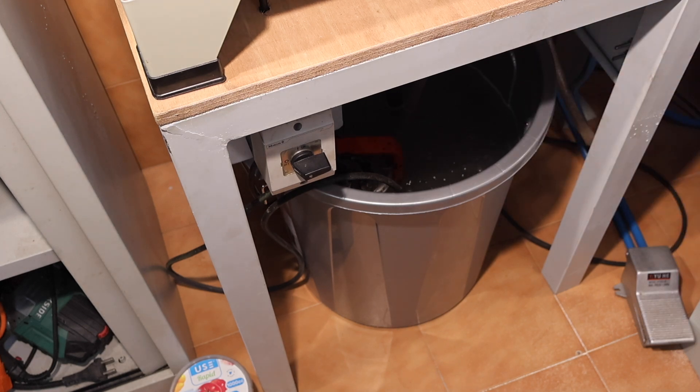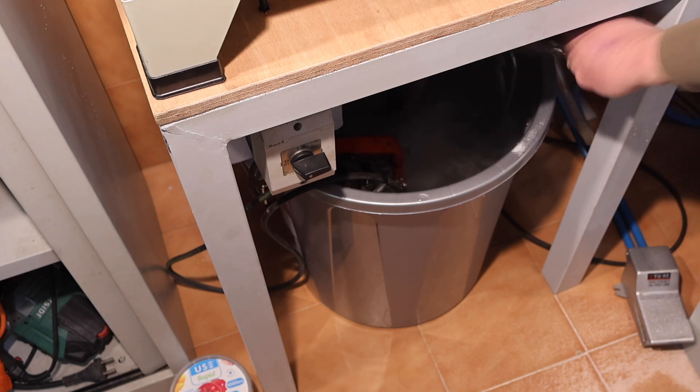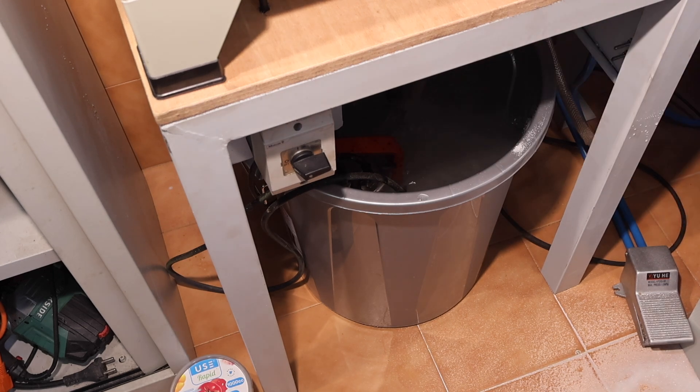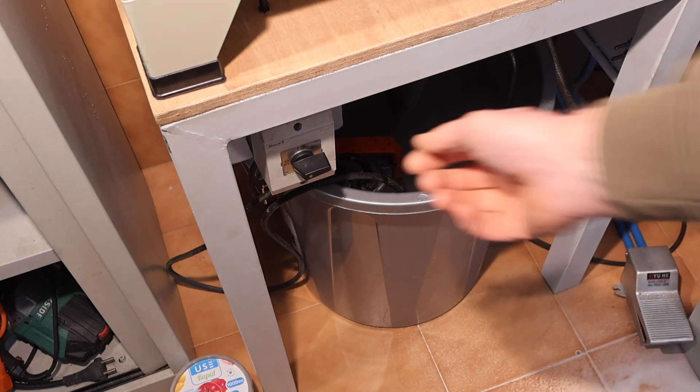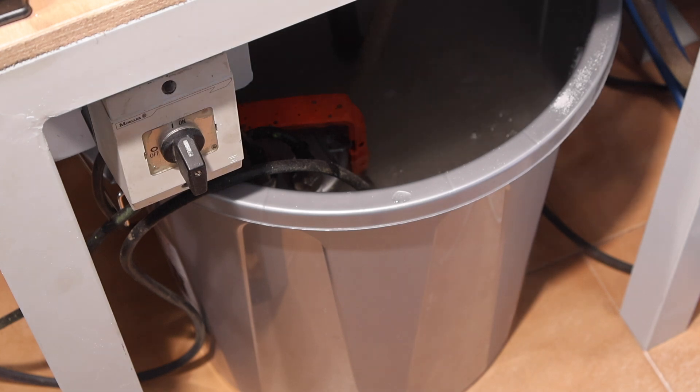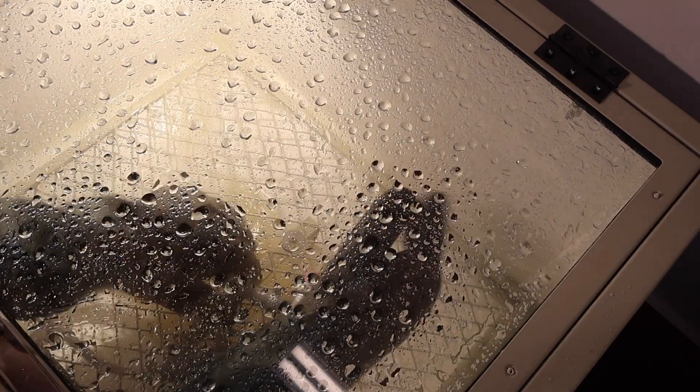The ratios — well, they're not really critical. I don't even know exactly how much I'm supposed to be putting in; I'm just putting it in until it seems right. Once a certain amount of abrasive is in, we'll switch it all on and see if it delivers the abrasive and water together. You can see the water is now agitating the abrasive and it's in suspension.